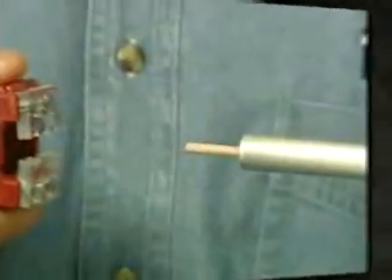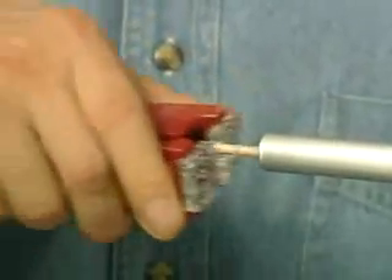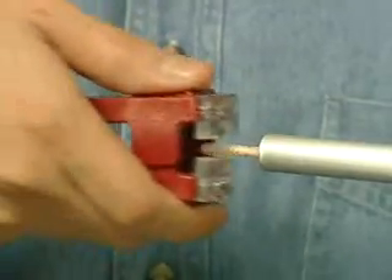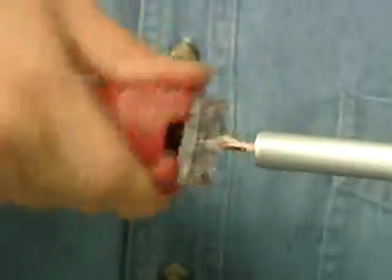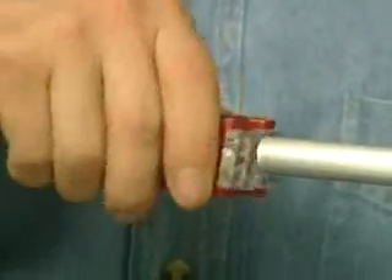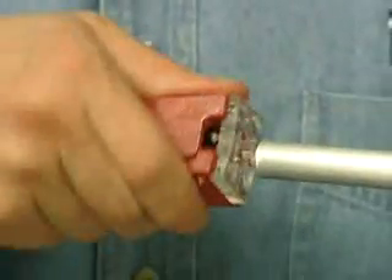After selecting the desired notch on the CC100, position the tool at the end of the aluminum sheath and clamp down on the conductor. Rotate the tool back and forth, breaking the dielectric bond. The dielectric material is then removed by simultaneously pulling and rotating the CC100 off the center conductor. Repeat as necessary to fully clean the center conductor.